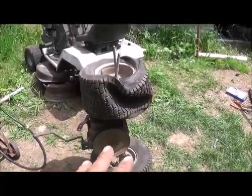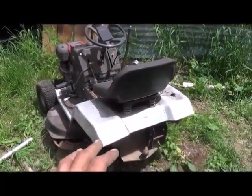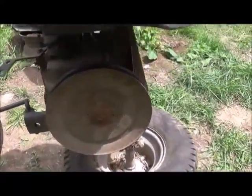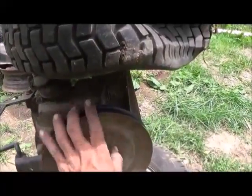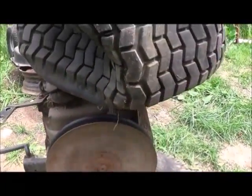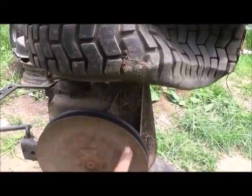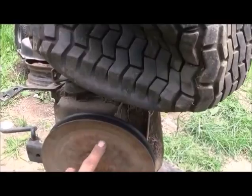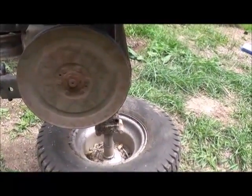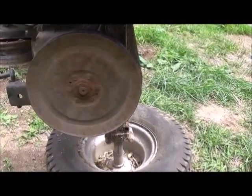Alright folks, I've ripped the rear end out of that riding lawn mower. I decided the frame and all the extras on it are just far too heavy for this project to start out with. So what we've got is this rear end — watch this tire up here rotate. This takes very little energy to get it to rotate, and if I can get this to work just right with the right windmill, we should be able to move this pretty efficiently down our rows. We're going to need some stability things, probably a wider tire stance, longer track, things like that to give it stability in the wind.